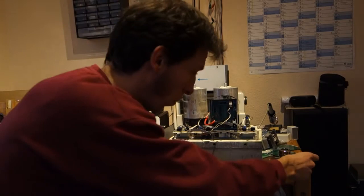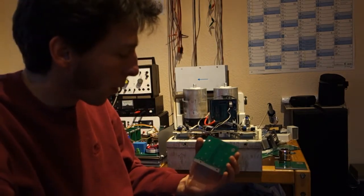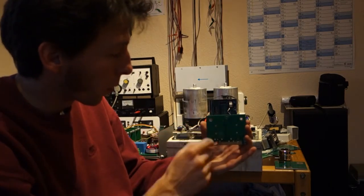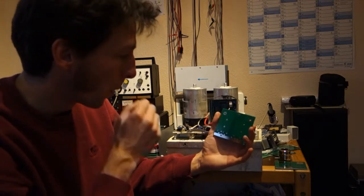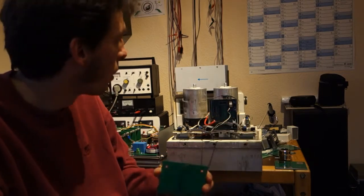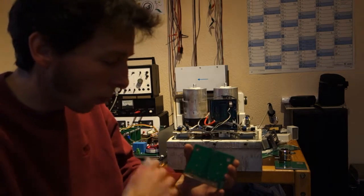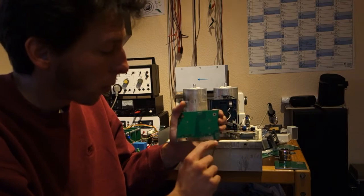So I made version 2, designed so the DC bus would be connected by standoffs — brass standoffs. It turns out brass standoffs have about three times higher resistance than the alloy pipes I'll show you in detail. This version also had a current sensor on it.